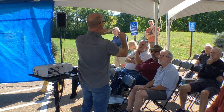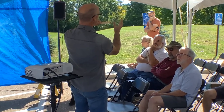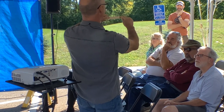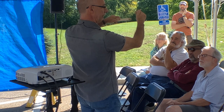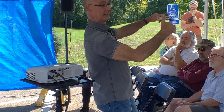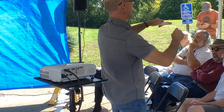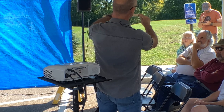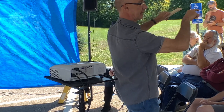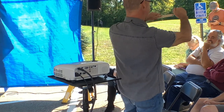I'm just thinking through whether I'm going to adjust or just move on. The bit could be just a tiny bit lower to make this lip a little bit smaller. Here's the dynamic. The shoulder on the back leads to, in the next step, how far the groove is from the back of the door. So if I raise the bit, the shoulder gets small, and that retainer gets small and fragile. Then someday somebody slams the door and the panel keeps going because it fractures out of the back of the door. If I go to the other extreme, if I lower the cutter and make this shoulder really big, the lip on the front leads to a shoulder detail on the front of the door, and that detail goes away. So we need to hit both.